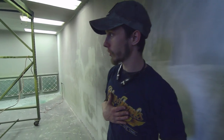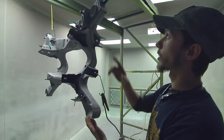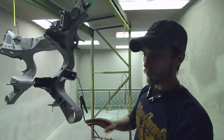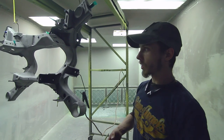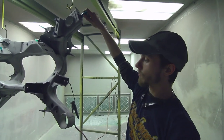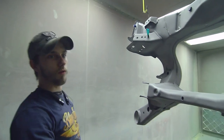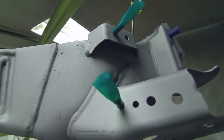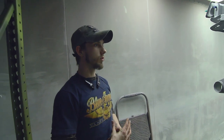I'm Alex, I'm here from Michigan Sandblasting and Powder Coating — I'm the lead powder coater. This is the subframe that we got down from sandblast yesterday. What we did is we hung it up here with hooks, blew it all off, went over it with scuff pads to make sure any extra contaminants were removed — paint transfer, sand, grease, anything like that. Then we made sure to mask everything as you see here — anything that is threaded or that we don't want painted. All of the threaded holes we plugged, to make sure those threads don't get painted, because if you paint your threads you're not going to be able to get your nuts or bolts back on. Right now she's ready to hit with paint and that's what we're about to do.